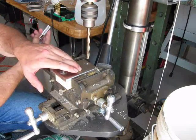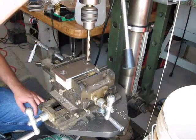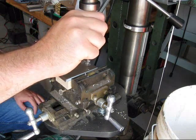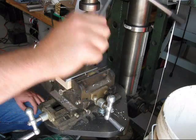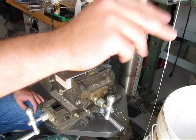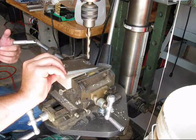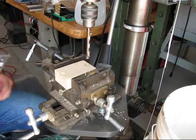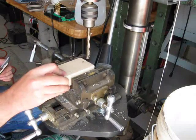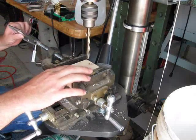The other thing you may notice: I'm doing two at once. It reduces the flexing that the plate experiences in the vise. And the other thing I did — I cut a block of wood to fit underneath the plate, and then drilled holes in it where the holes already are in the plate, so that makes it lay flat.